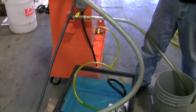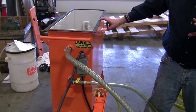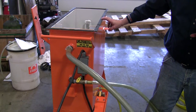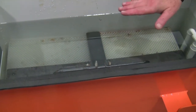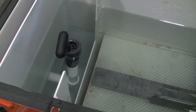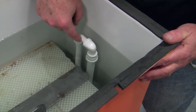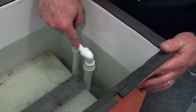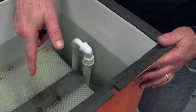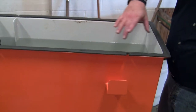Now we're pretty much ready. The next step is to fill the tank with new, fresh, clean coolant — this holds 30 gallons. You don't want to use this on a 30-gallon sump and try to operate it because you'll suck it dry, so always start out with a tank full of fluid. Once filled, the level should stay constant based on the discharge hose outlet height. This pipe is where the dirty fluid enters the tank — we bring it from the bottom up and then back down. We drill a small hole in the elbow so that when you turn the power off, you don't siphon all the fluid back out. We try to force the fluid all the way through the media to get as much oil out as possible.